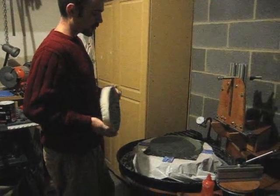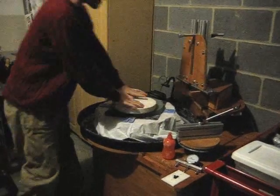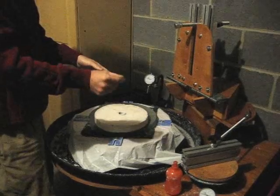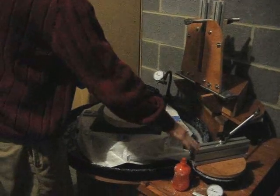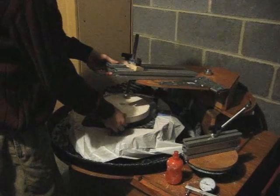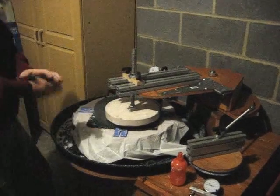I've already got some water and grit on the mirror and I'll show you how the Mirror-O-Matic works. I've got it set up right now for a stationary overarm, which means the overarm will have very little movement. I've got maybe a half an inch of movement from the eccentric drive — as this turns, it makes the overarm go back and forth just a very small amount. The overarm fits right down to this hole and I have about a 15% overhang.